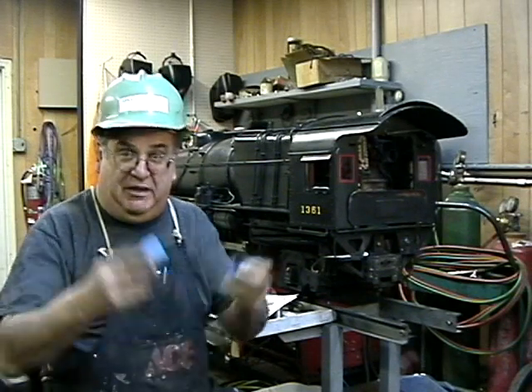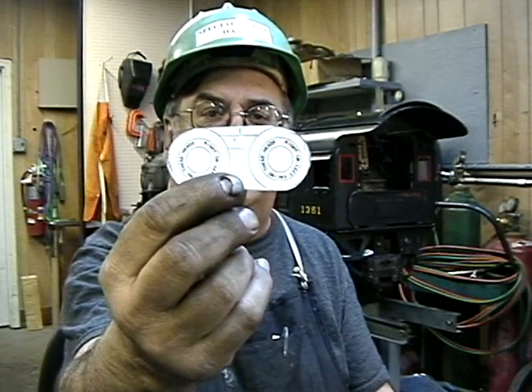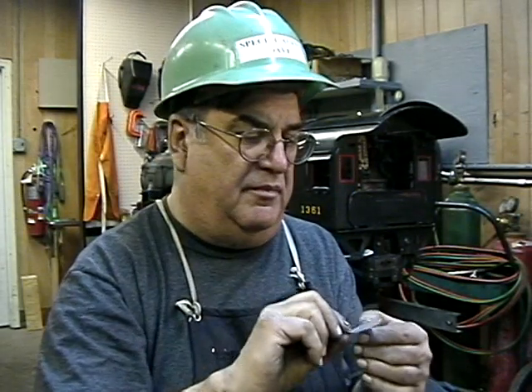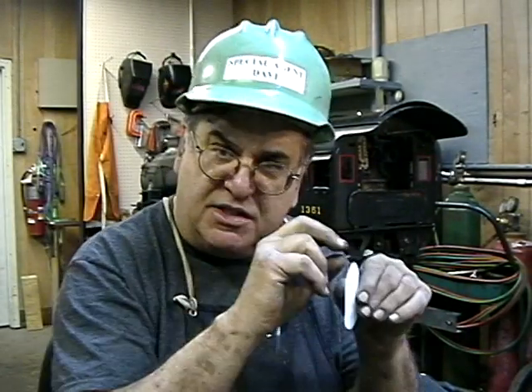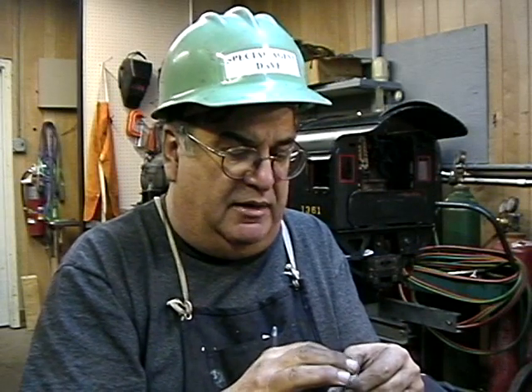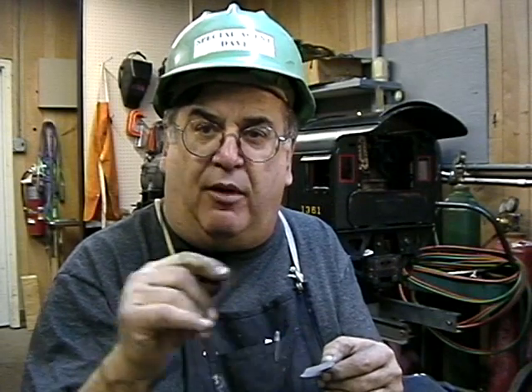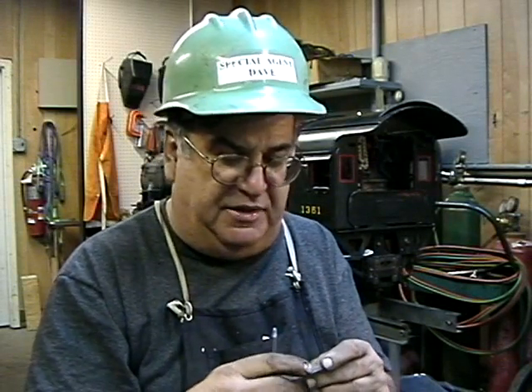He didn't have very much, was very poor. His ultimate goal — he used to play with these. Another thing I have is the heads, and I'm going to make those up. The writing is going to be an etching and then I'm going to inset it as an inlay and silver solder it in — that will make the heads. I'm going to make one extra so I have it as a model for my white metal casting machine. Eventually I'll make them out of white metal, but right now I don't have the machine set up, so I'll make three and that'll take care of the head problem.